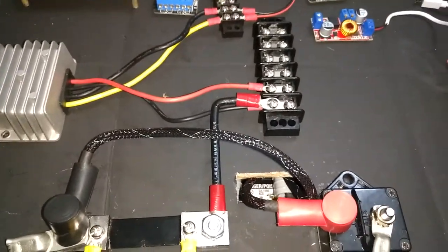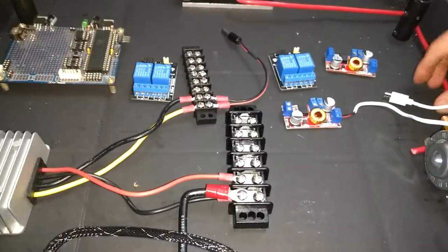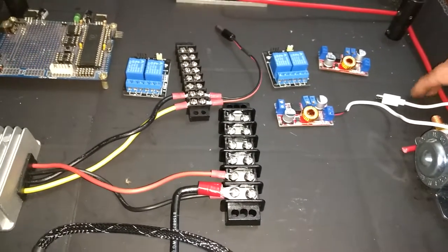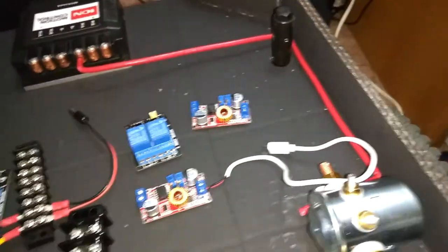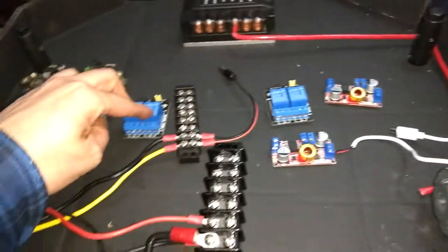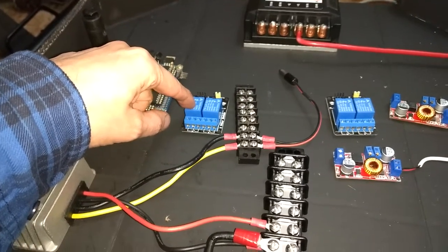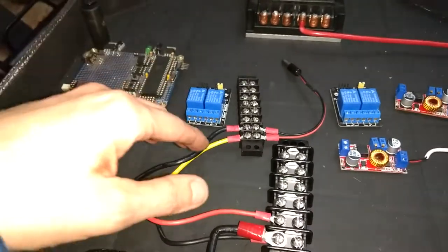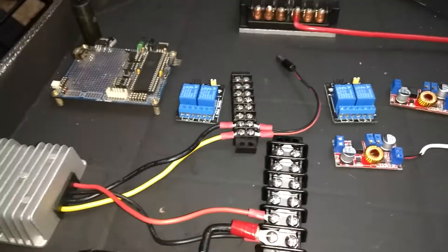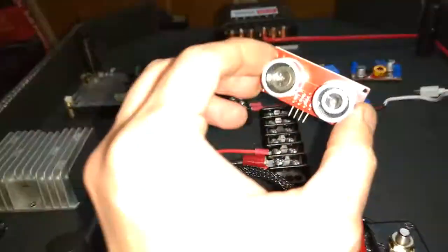So this is what I've got so far. There are going to be some cutouts over here by the wheels for the motor wires and brake cables. These relays will handle I think five amps DC — I'll have to check the datasheet — and it won't take more than three amps to power the brake. After that, the only thing I'd be working on are the sensors.